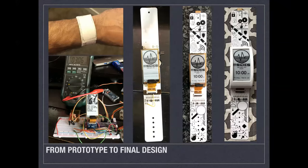Here's the design flow of the badge. The top left is my initial prototype — a piece of paper pretend watch I wore around for a few days, much to my kids' embarrassment. Then I went to the breadboard prototype. You can see my multimeter hooked up; I had to be very conscious of power usage — in that screenshot it's showing three milliamps during typical running. My first PCB prototype is in the center, with a little yellow wire where I had to fix wiring errors. I have to thank ConfuKid for helping me solder the SMD components. The final production run shows one with the 3D case and one without.